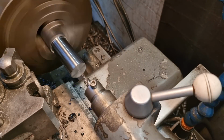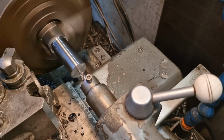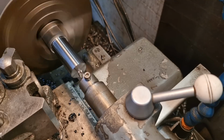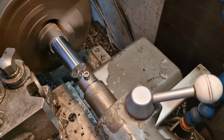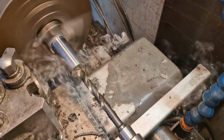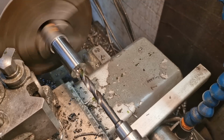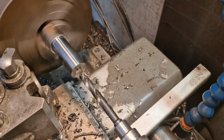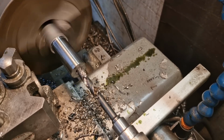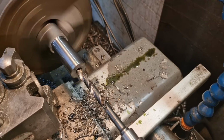Right, so going with the centre drill, as always, to get things started. And my usual pilot drill is 10mm clearance, so we'll be golden there, like. We'll just switch out to that now. And we want 40mm, don't we? So I'll take that in 43, and that'll allow for the parting off blade. Like that, so that's down to depth. Happy days, move that out of the way.